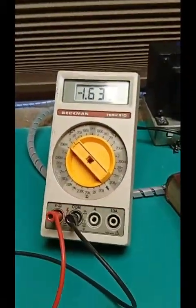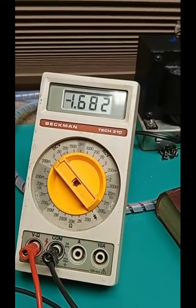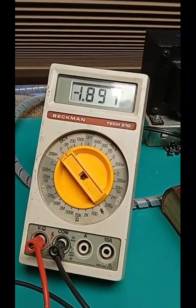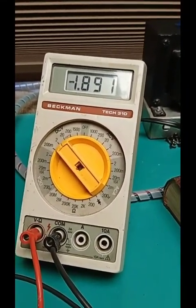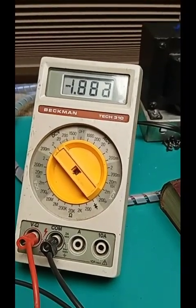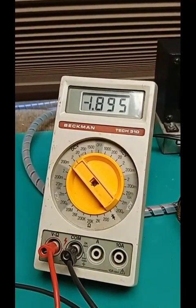40 meters, get a stable DC voltage on the voltmeter, then tune it for a max, and it was down here, and it should be up here. See, it's picked up almost 200 millivolts. The reason it was that far off is because I tried to adjust it by hand without the alignment load, and that goes to show what a gross error that causes. So ignore the people that say the alignment load is not necessary. They're wrong. Because I had peaked it by ear. It was way off. Now this is for 40.